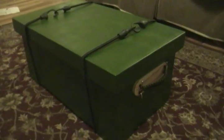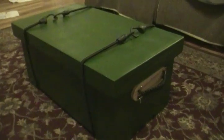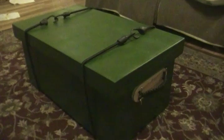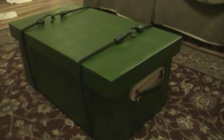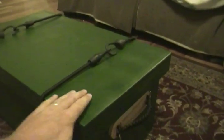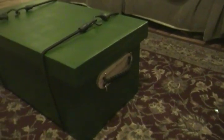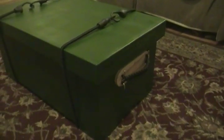It's made out of medium density overlay, which is a high grade plywood with an MDF veneer on both sides that will take paint well and is also highly resistant to water penetration. The trim around it like the top is MDO, but then the sides are oak, and then some of the accents I put on there I didn't bother to paint — I just stained them or sealed them and made those out of oak as well.